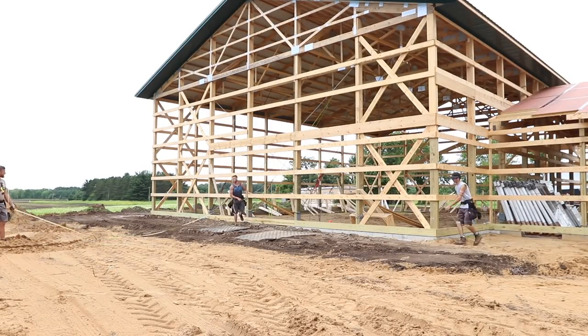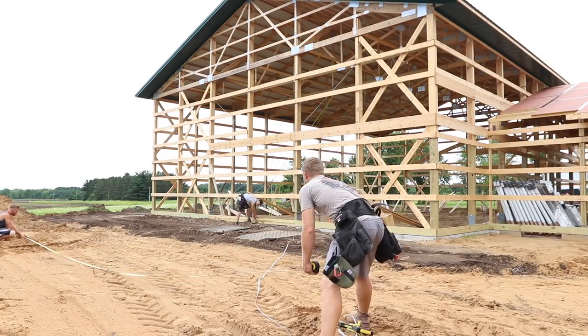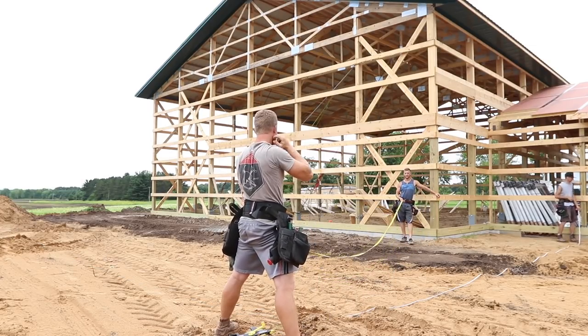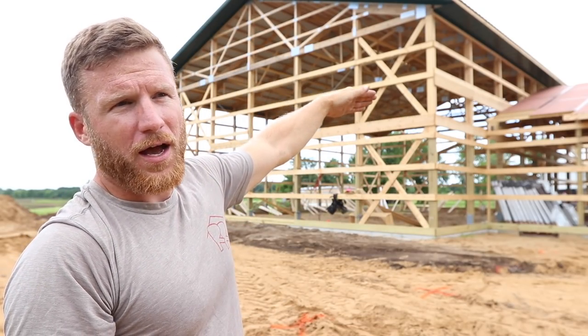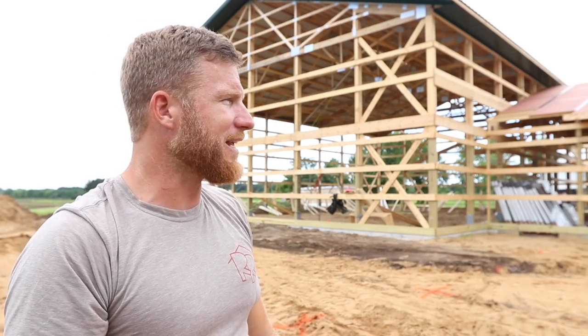This side was a lot easier because we didn't have a bunch of different outside corners like the north side of the building, where we had the 24-foot pavilion that came back into an 8-foot wraparound porch. This is pretty easy. It's just going to be a 30-foot gabled out roof, and it's going to come all the way back. And part of that wall on this side of the building is going to have 8 foot of that roof line. So it's actually quite easy.